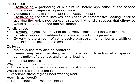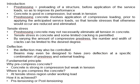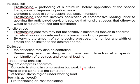In terms of deflections, pre-stressed members can help to control the deflections. The beam may even be designed to have zero deflection at a specific combination of the pre-stress and the external loading. These are the fundamental principles of pre-stressing.